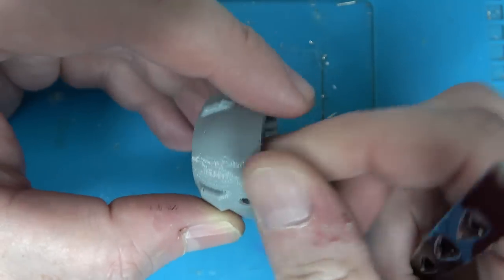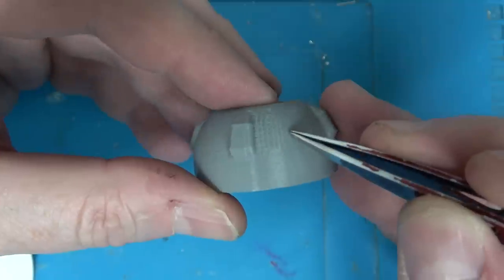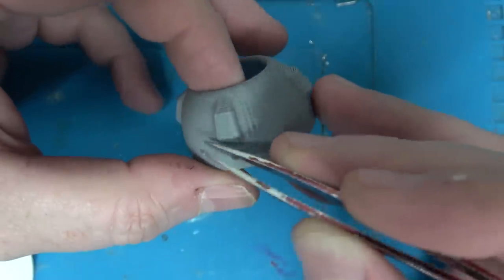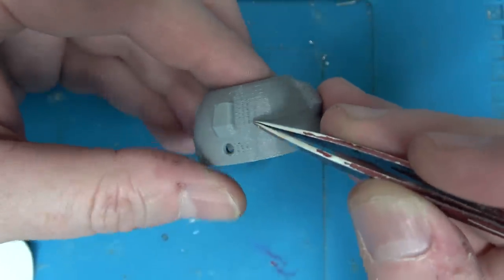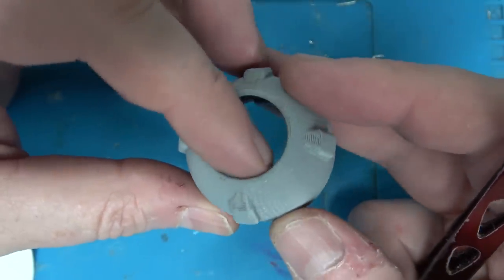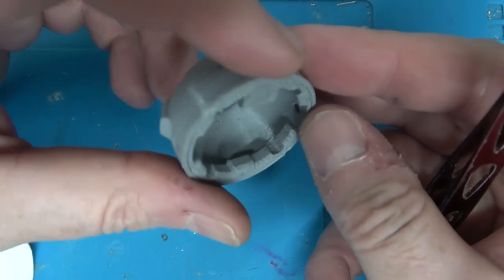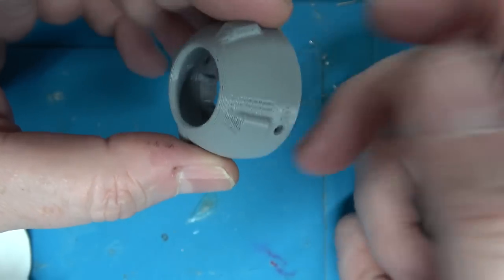As far as the layers themselves, like here it might have under-extruded very slightly, but the actual layers themselves are still pretty good. I would say it's not an amazing print, but for what it is after all these years, I think it's definitely serviceable. This is a coarse print — it was printed at 0.3 layer height.